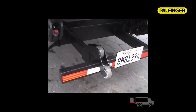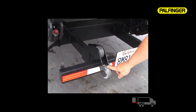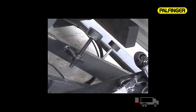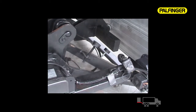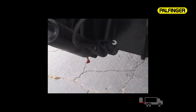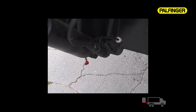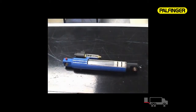High-quality bronze bushings and hardened alloy steel pins are used at every pivot point, and our pins are clip-free because we use hardened bolts that won't fall off or wear out. The ILT platform closes with the assistance of rollers mounted on the three-piece impact guard, giving it smooth action and long life. When in the closed position, the platform rests on adjustable rubber cushions to protect it from bumps and road vibration. The key to the ILT's reliable, safe, and secure operation is the hydraulic system together with the dual release valves. Most competitors offer one release valve at the end of the hydraulic hoses inside the power pack. On the ILT, they are located directly at the lift cylinder port.